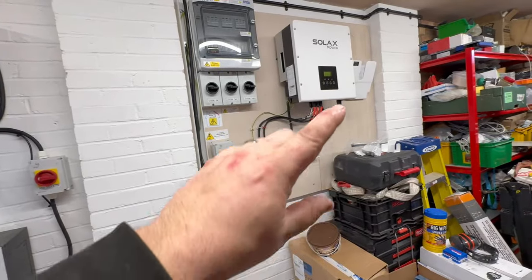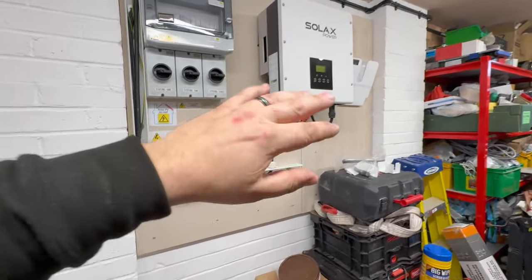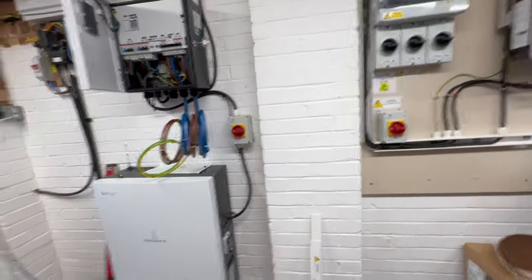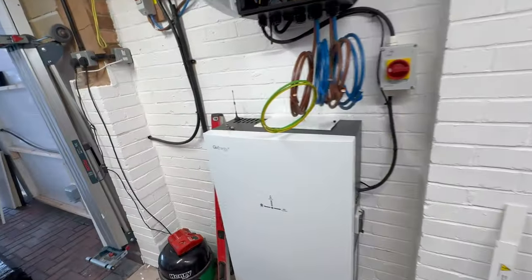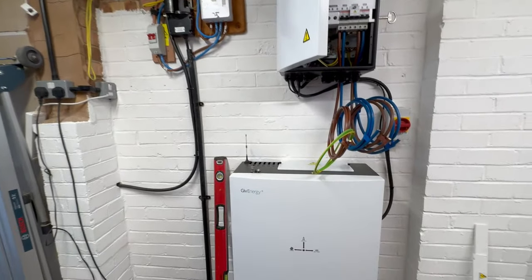We've got all of the isolation points within the gateway itself and the normal household consumer unit. You need your earth reference in islanding mode, so that's all in place. We've got our bond on the inverter — bonded up onto the inverter casing as well as having an earth in the lead. The PV is on a chunkier cable than the AIO — 6mm on the AIO and 10mm on the inverter. The reason is if this was ever to hit its peak 8kW rating you're pushing the capabilities in the trunking, so that's the difference in size.